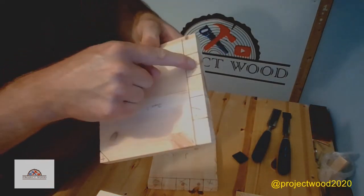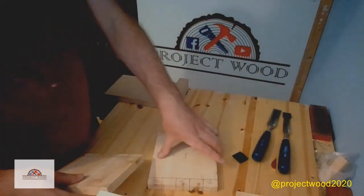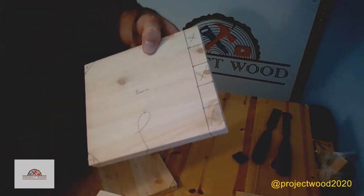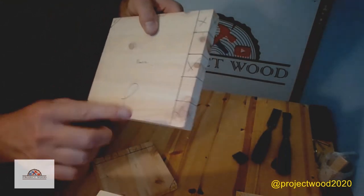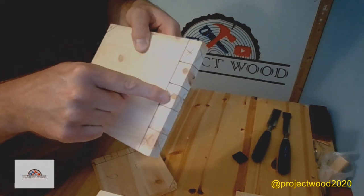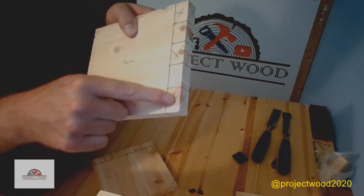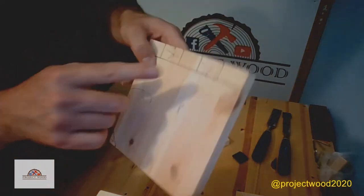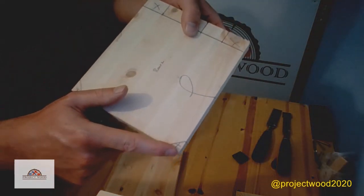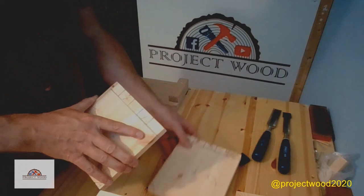We have a couple of female parts of the finger joints to remove, a few little chamfers. Same on the male piece, a couple of chamfers, and we have two pins to leave in as well. So from making the sides of the birdhouse, these should be no problem. We've removed corners like this before, and we have removed material from the center of the joint as well. So I'll just go through the cutting out of one corner here and the removal of one of the female fingers here as well, and one of the chamfers. And you just repeat that then for all the other pieces. Again, you're going to have to do some fitting as well of the joints once these are done.